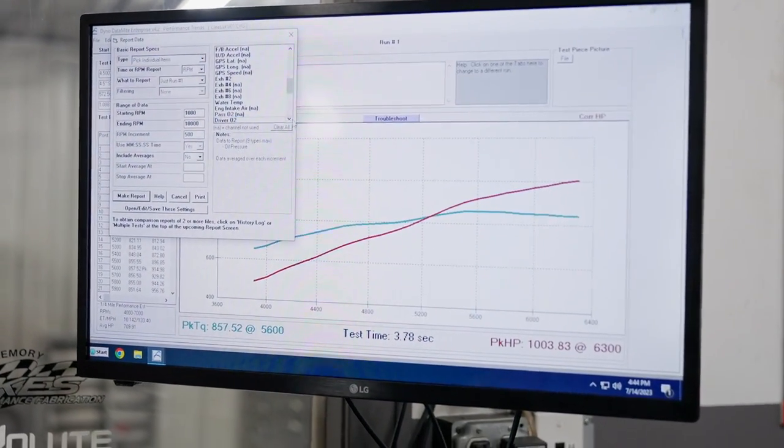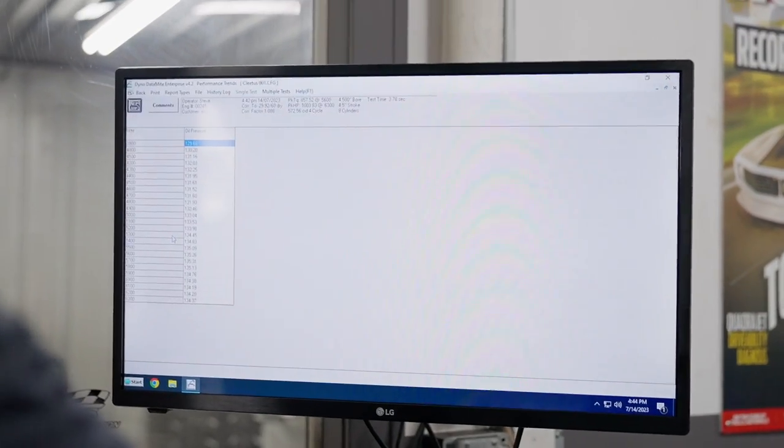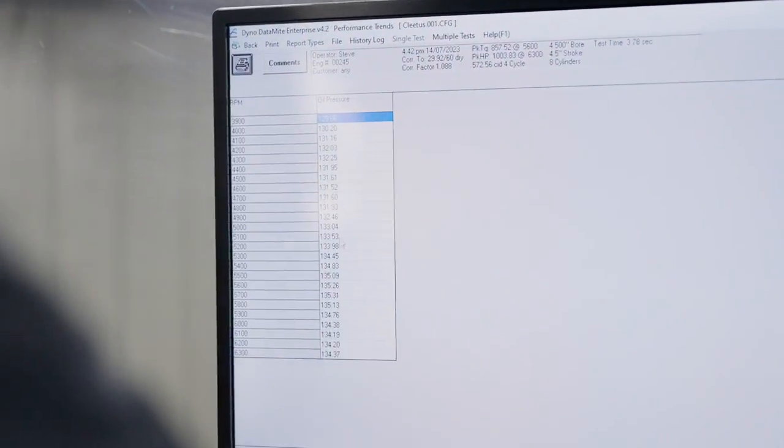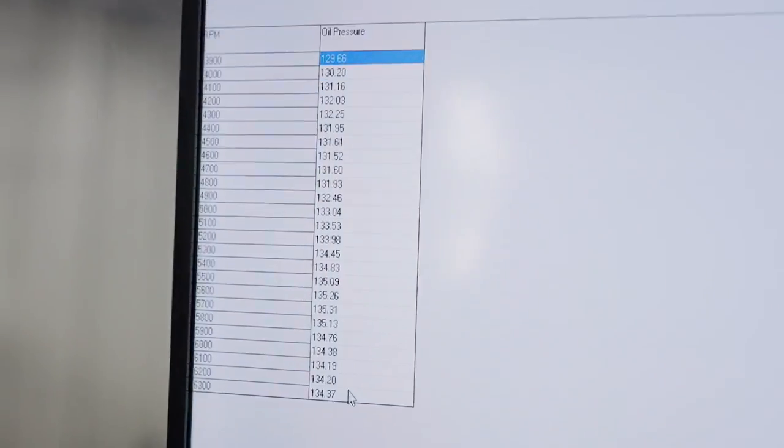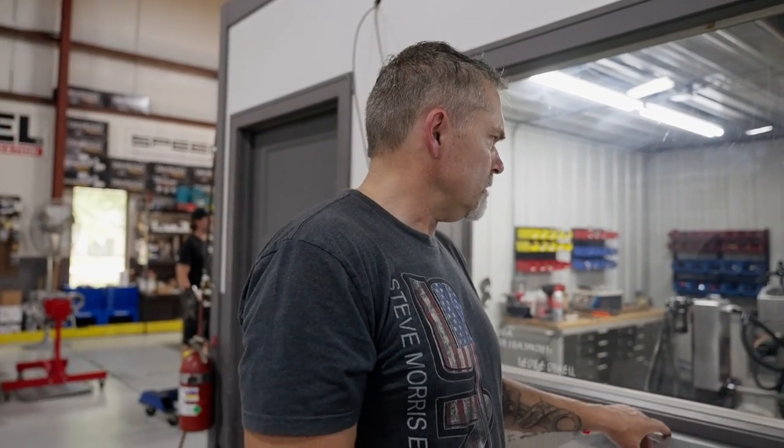Don't have that on. I think that's it. Oil pressure, nice. 134 pounds. That's about what it should be. The oil's not hot, and it has a straight 70 weight in it, which I normally run. When these things get hot, and I have the bypass jacked all the way up on it,